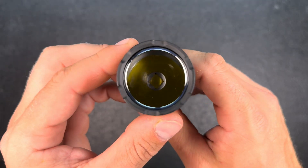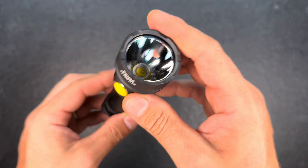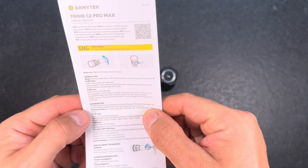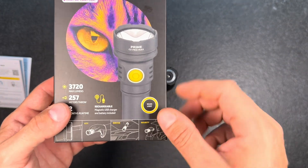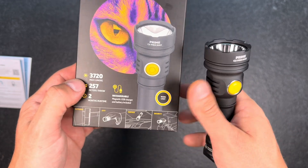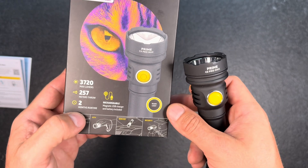There's no indication about the LED type in the manual, but for me it's pretty clear — it's an XHP 70.2 with about 3500 Kelvin. They don't put all the technical specifications in the manual; most of it is printed on the box or you can find it on their website. For the warm white version the maximum output is 3720 lumen, and for the cool white version it's about 4000 lumen.